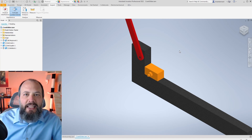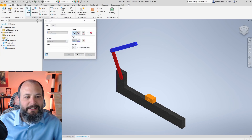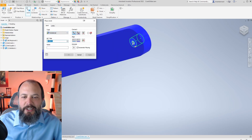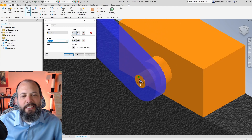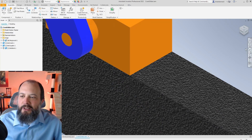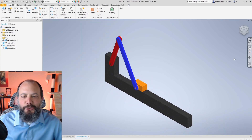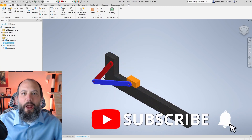Be careful and understand the limitations. To finish this crank slider, I need to add one more pin joint. I go back to the Assemble tab, hit Joint, scroll down to Rotational, zoom in to click the center of the hole on the coupler, then zoom in again to click the center of the pin on the block. I hit Apply and Cancel, then zoom out. Now I can left-click on the crank and manually rotate it — I have a completed working crank slider.